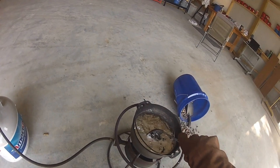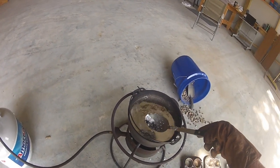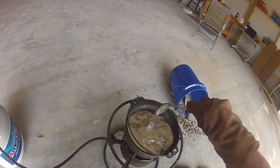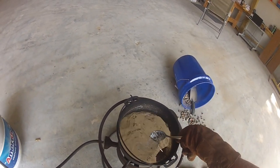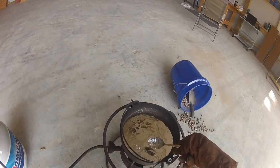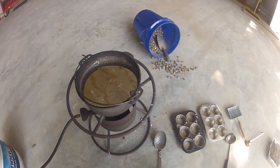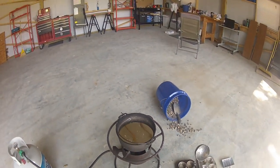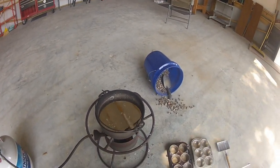I'm going to switch to a little spoon now. See how it's almost like a mirror? I'm not going to go for 100% getting the lead clean — that's pretty good right there. This is just making the big ingots, basically lead ingots. When I melt it down again to actually make bullets, that's when I'll do the final purification, just the same way.